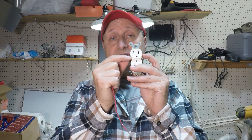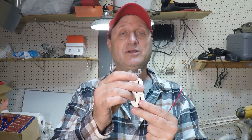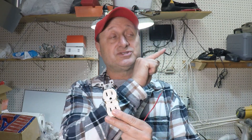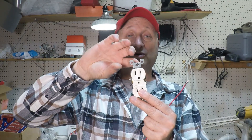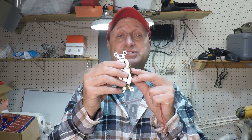If you have an outlet that is not connected to something right now and it's still hot, it's likely an outlet where you've got power passing through it and continuing to another one. It's also not wired properly — meaning there are loose connections creating that heat. Even though there's nothing plugged in, the wire coming in hitting the power screw and then going to the next outlet means all that energy is passing through this outlet. It's either too much draw or you've got a loose connection going on.